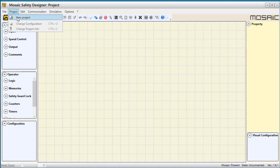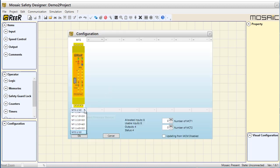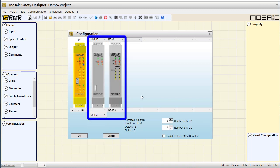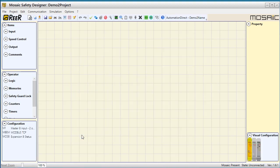Let's use the workflow from the previous video. Step 1 – Configure the system. I'm using the same configuration as in the previous video so there's no need to change it here. Even though we are not using these modules in this tutorial, we do need to show them in the configuration because they are connected to the controller. The relay module is just a passive unit with relays and contacts inside so we don't add it to the configuration because the controller doesn't need to communicate with it. Of course, your configuration will probably be different.